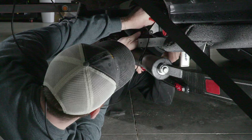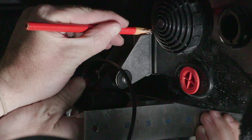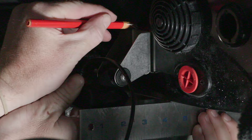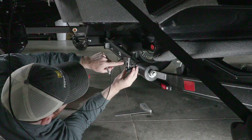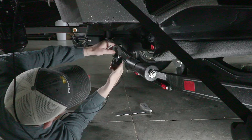We want to check to make sure that we get that clamshell approximately in the middle, because this bracket has a little bit of travel, but we want to get right where we approximately think we're going to be. We'll make a mark using a straight edge to determine where the middle of the clamshell or bottom of the boat is. Then we mark the holes to drill, right in the center, so we have the ability to adjust up or down in the future.